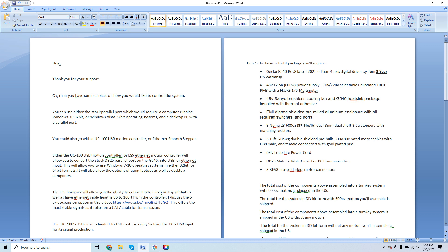Here's the basic retrofit breakdown — I go through everything required. The main addition in this particular case is the 600 ounce motors because he specifically requested them. I always give the option without motors, because it's truly up to you whether you want to change them. You can use your stock motors as long as they don't exceed 3.5 amps. I've never encountered a 6040, 6090, 3020, or 3040 that exceeds that amperage. The 3.5 amp limit exists because we don't want to exceed what the G540 can distribute — peak amp, with RMS being about 70% of that, so roughly 2.7 amps.